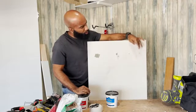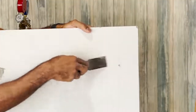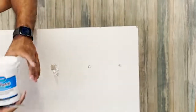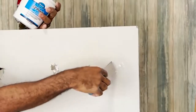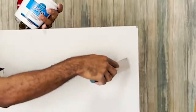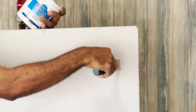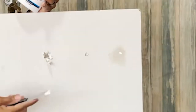So this hole here — straight, simple, regular nail hole. You'll take your spatula and just go over the hole, make sure everything's smooth, it's not catching anything, everything is fairly flat. So you'll just get your spackle, open it up, pull a little bit out, and just press it in the hole. Hit it from all sides — up, down — make sure you fill the hole in, that's all. That hole is basically done.